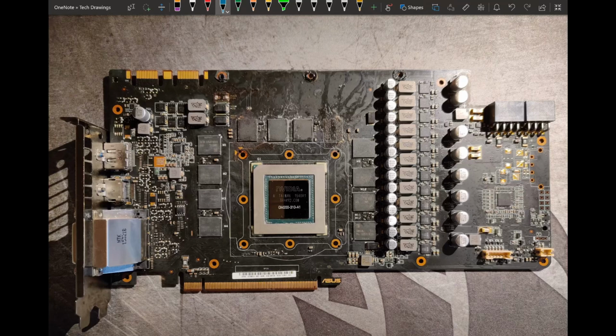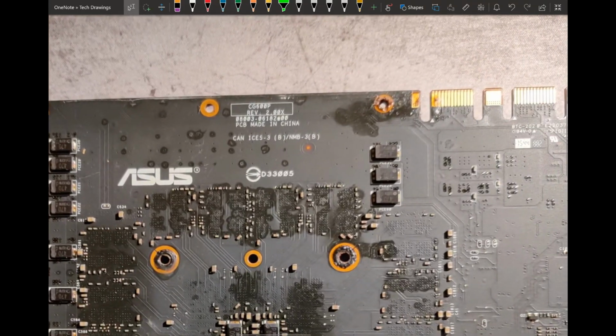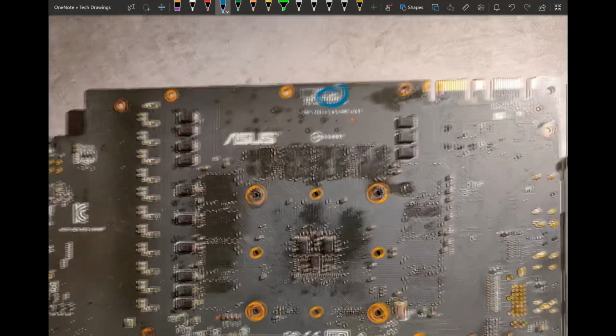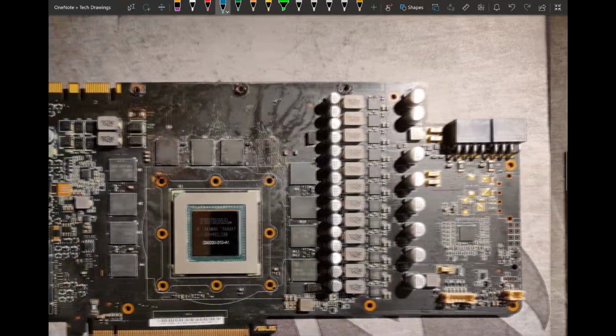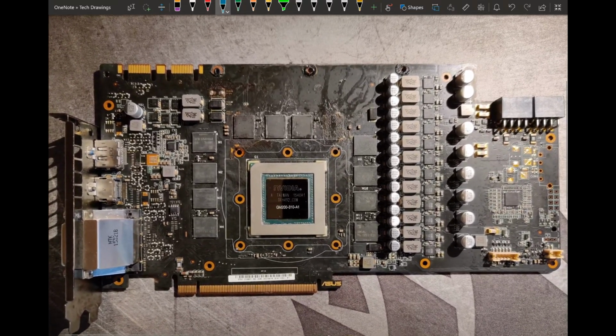We've already had a 980Ti Strix, however that was the other revision, which actually has some pretty significant differences in how the VRM, specifically the vCore VRM, is built. So I wanted to revisit this revision 2.0, as you can see here, and look at this one, because I think this one is actually better. Like sometimes you see revision 2.0s being cheaped down variants, but this one's actually a beefed up one.